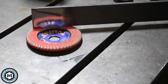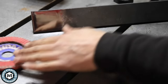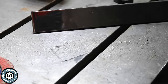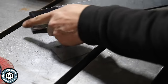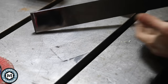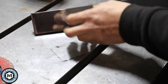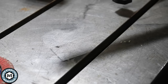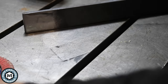This is now a nearly perfect mirror polish. You can see the way it reflects the piece below it. I left some heavy ripples in this when I was grinding — if I had taken a little more care to flatten it out before going through these steps, there wouldn't be as much distortion. But you can see from mill scale to polish in basically four simple steps, really fast, provides really good results. The way you can really tell the clarity of a mirror polish is the distance at which you can see a reflection — I can hold this two feet away and very clearly see my own reflection in it.